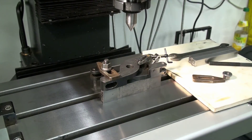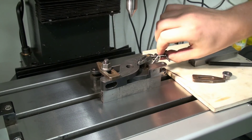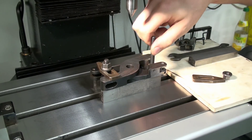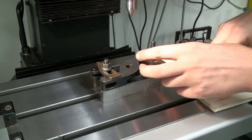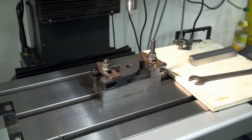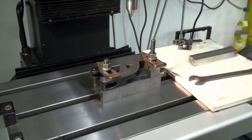Pull back the center, remove our little clamp over here, and set up a second strap clamp. I zeroed the DRO over the hole and now I am clamping the table for boring.